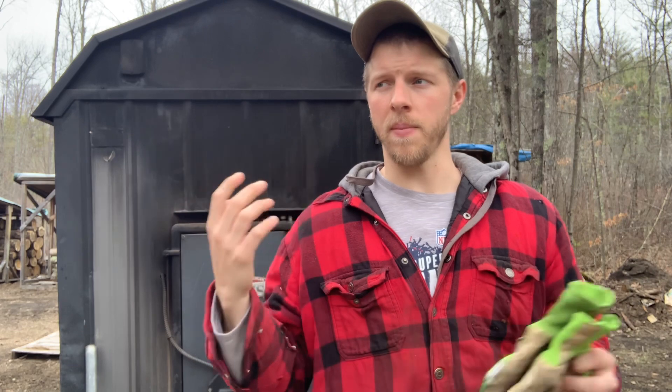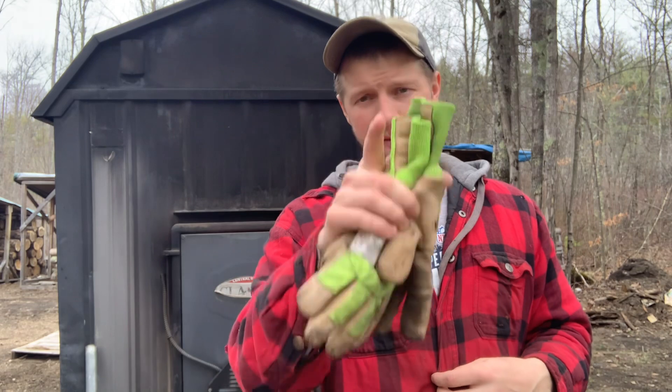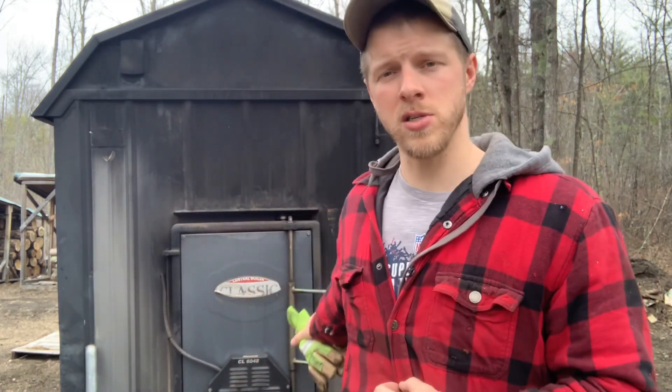I just wanted to make this little rant — hopefully it helps. Again, this goes for all makes and models: run it at the highest temp setting. You are least prone to condensation and moisture, and your thermal expansion is at a minimum because everything is at its peak running temperature, just like your car. I'm Jay — thank you for listening. We've got more outdoor boiler videos coming, a cool cleaning series, and a company sent us something to help clean and treat this machine. We've got a lot of maintenance coming up as we near the end of the heating season. Stick around — we're going to grab some wood, stoke the flames, and give a subscriber shoutout.